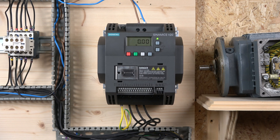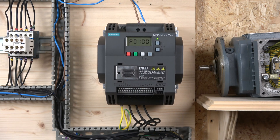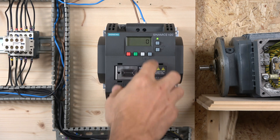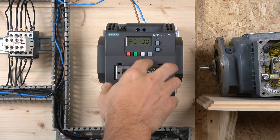One group is transistor digital outputs and the other is relay digital outputs. Regarding the display, it's quite straightforward — you just click M to enter parameter setups. To get back to the home screen, hold M again. To enter the setup menu for commissioning, hold M for a couple of seconds and it takes you straight to p100, which is your first parameter to edit. Press OK to enter a parameter, use the up/down buttons, and the red and blue buttons are for starting and stopping the drive in local run mode.